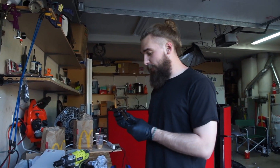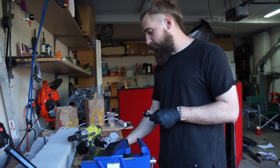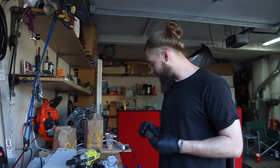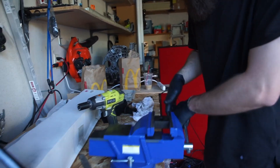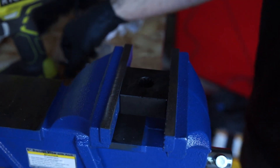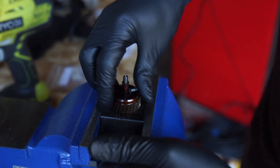Now we're moving on to doing the rattle kit repair on the splines. When you buy the Vanos repair kit from ECS, they send you tools to do this job as well. They send you this block — you put it into a vice grip and tighten it. It's metal so don't be afraid to tighten it pretty hard, and then these shafts go into the splines.